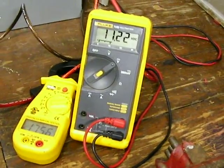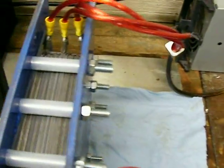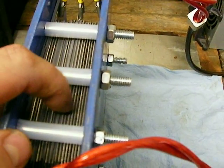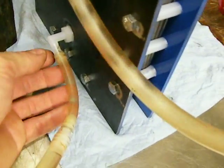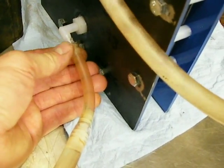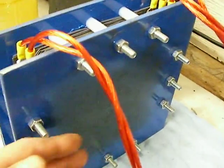Advanced hydrogen — I'm running a 21-plate, 6x6 cell for the first time. This time the spacing is not my usual 1/8 inch; I'm doing 1/16th. I'm going with advice from fellow YouTubers who suggested running a quarter-inch input on the bottom and a 3/8 exhaust. That's what I've done, and I have an adapter because my bubbler is 3/8.